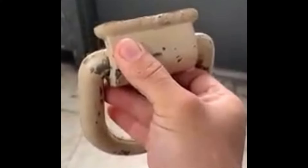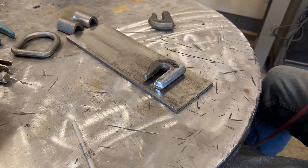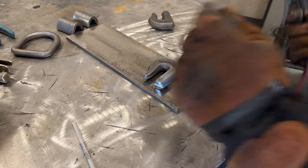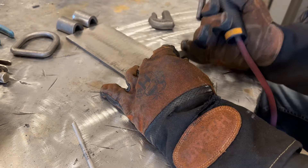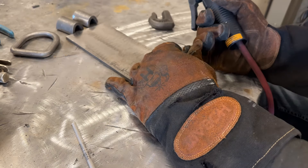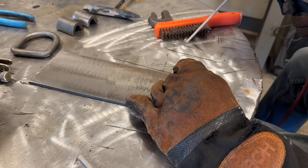The D-rings in this video are capable of being welded with short circuit MIG because it's quarter inch plate, though flux core is still smarter due to increased penetration. The hooks, however, are not capable of being safely welded with short circuit MIG in my opinion. So I've got a 3/32 rod, running a little on the high side at 105 amps just for the tack - I need it to melt in hot. I don't need a weak tack.